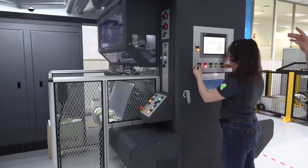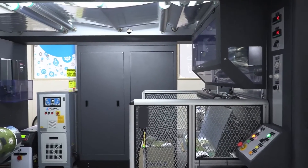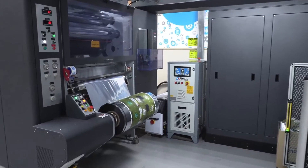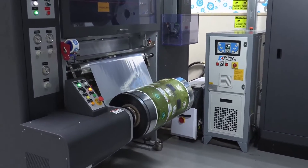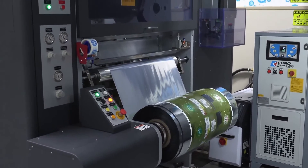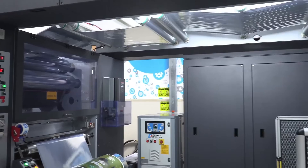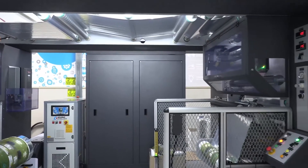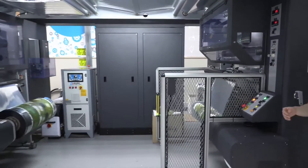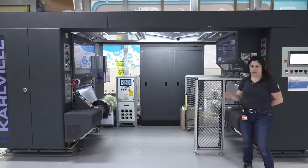There's a bridge here — it's pretty accessible for the operator. This machine has very operator-friendly features. It also has two corona treaters: one for the printed film and one for the overlamination film. As the speed goes up, you can see the dimensions of this machine — the unwinder of the printed roll is up to 800 millimeters, so we can cope perfectly with the 25k.